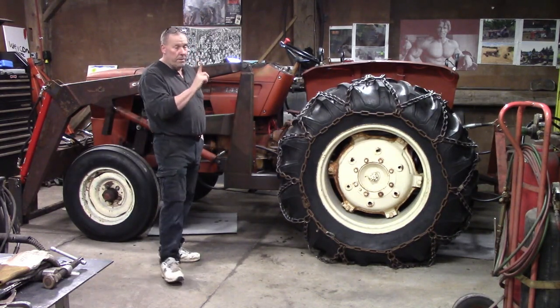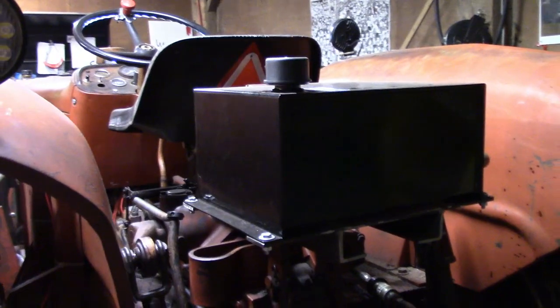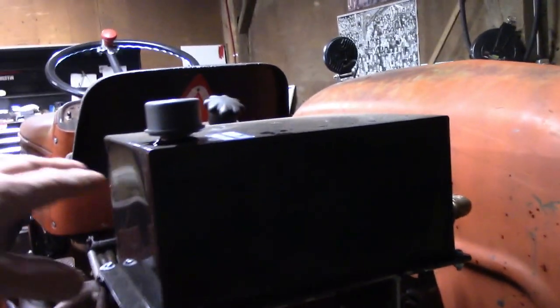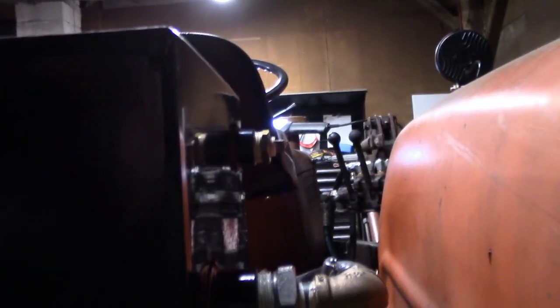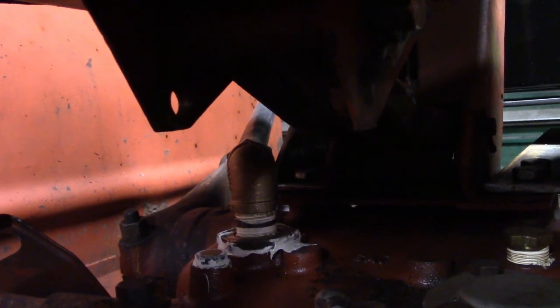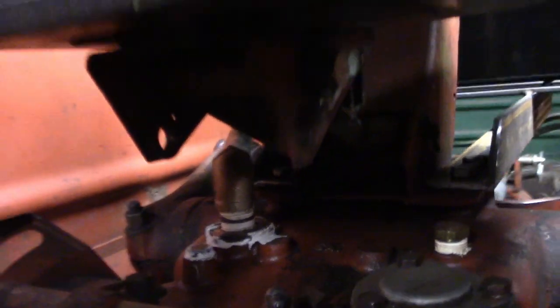Here's what I did to solve it. Looking at it from the back, I've added an auxiliary tank. The tank sits a little higher than the built-in reservoir. There is a three-quarter inch hose on the side — I ran that hose all the way around and put it in where you would normally fill the reservoir, where that 90-degree elbow is. So now I've increased the capacity of that reservoir.